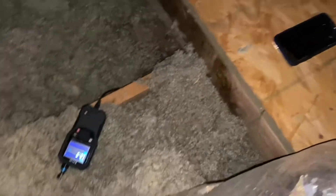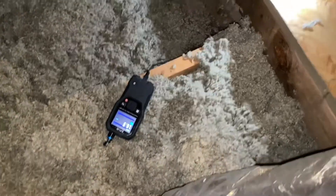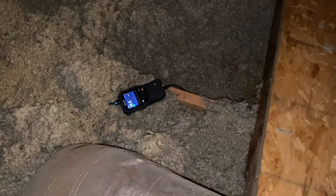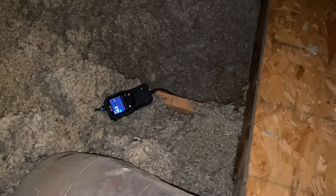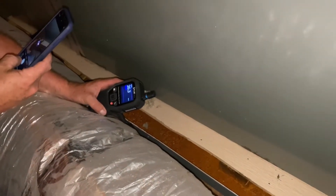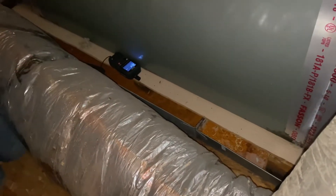That's a little elevated. It's not terrible. But you want to have drywall within — 16.5. You want to have it down less than 12. Yeah, that one is higher. It's wet. I just got my fingers wet. I'm surprised I'm not reading higher than that.